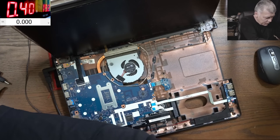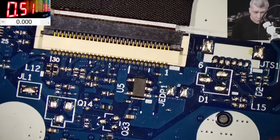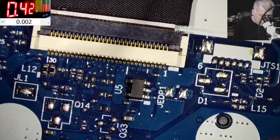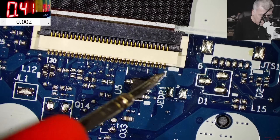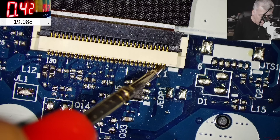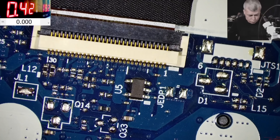We've spoken many times about the signals you need on the screen. The old ribbon cable smoked, so it's very possible that the 19 volts is missing on this screen. Always look on one side of the connector where the pins are connected together - you should have 19 volts there. Checking now - it is 19 volts. Good, 19 volts is confirmed.